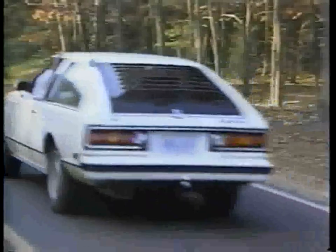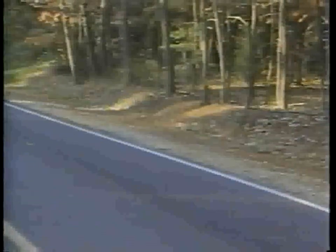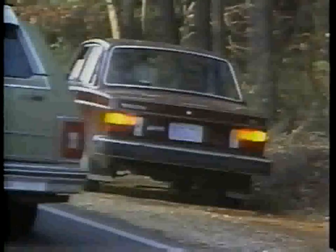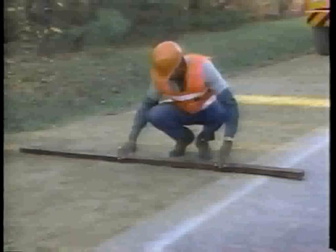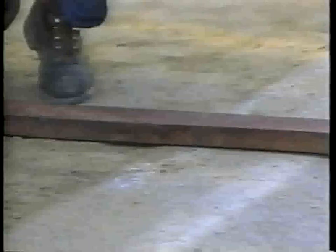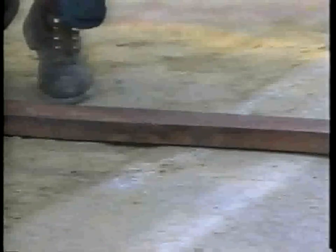Road shoulders are important to the roadway because they help drain water away from the pavement surface and give side support to the pavement. They also provide a safe area for emergency use by vehicles. The edge of the shoulder must be level with the pavement, and its cross slope must be steeper than the pavement cross slope for water to drain easily from the roadway.